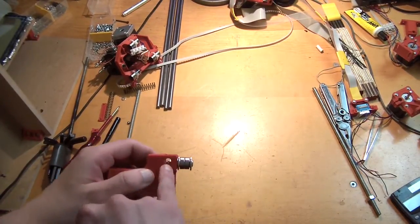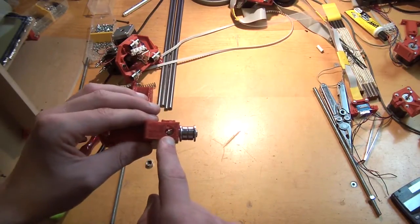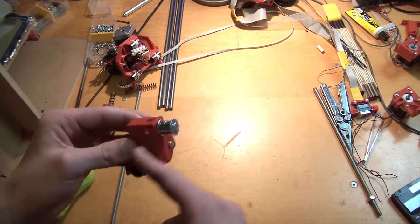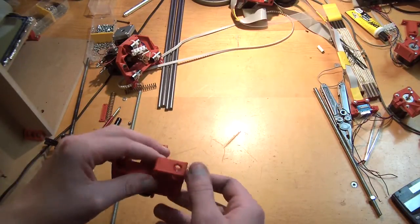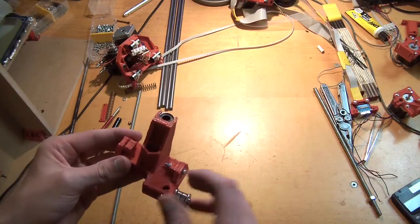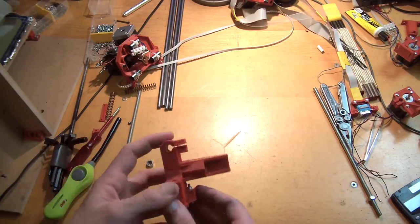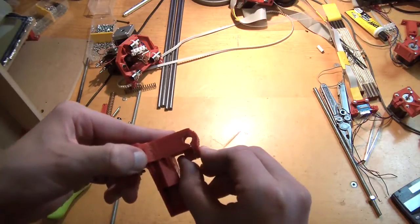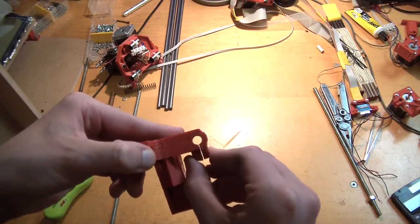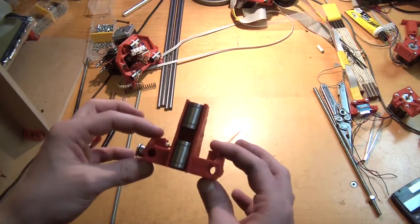If you do not have a screw long enough, you can drill a hole through here and put a nylock nut in there, but it's not ideal because you have quite a lever and the part is not made for that. Apart from that, you have two more nut traps, but you don't really have to use them — those are there for the compression of the bar clamps to hold the smooth rods in place, but they don't really move at all anyway.